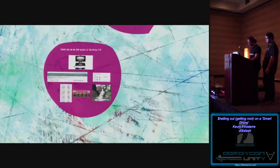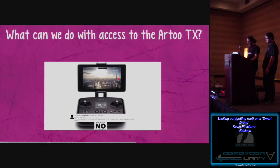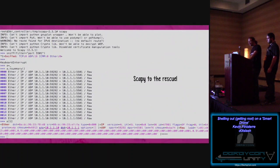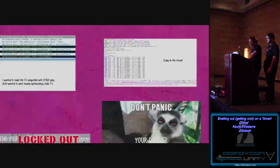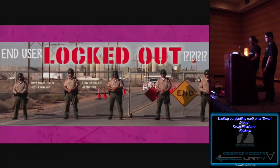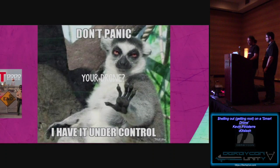A lot of people asked: is it possible to use this transmitter with other drones? The developers and vendor said no — that's nonsense, you completely can. I started sniffing the stream — it's basically a UDP protocol. I found that using Scapy it's real trivial to duplicate the protocol. The packet structure is literally: timestamp, sequence ID, and then PWM of all the channels. So you can inject anything you want into the telemetry stream. You can connect into somebody's transmitter, turn it off, and prevent them from accessing it. This is just a Linux box — I can cut you out of it anytime I want, and there's really nothing you can do about it. Likewise, I can take control while you're flying.